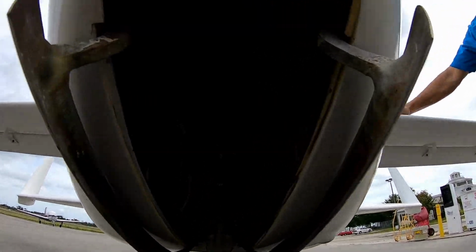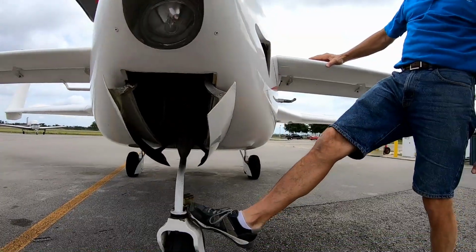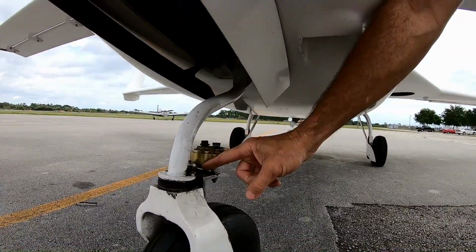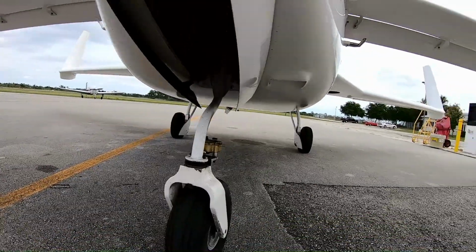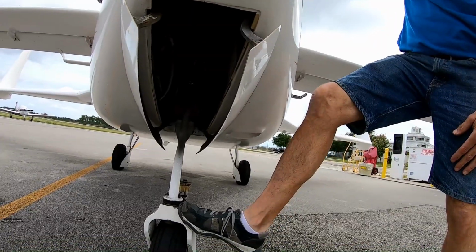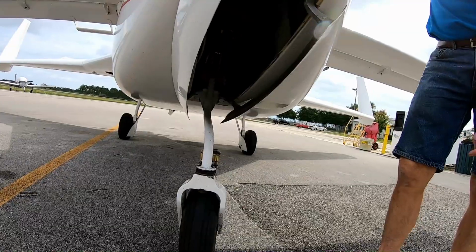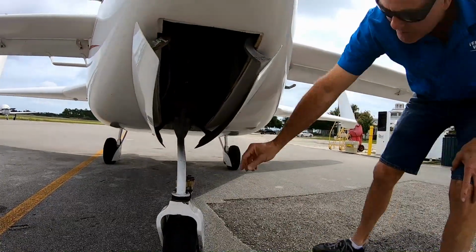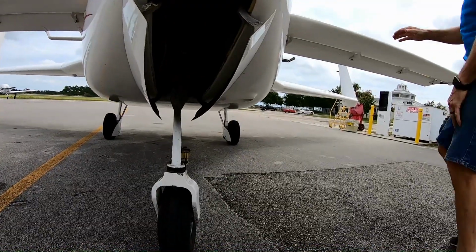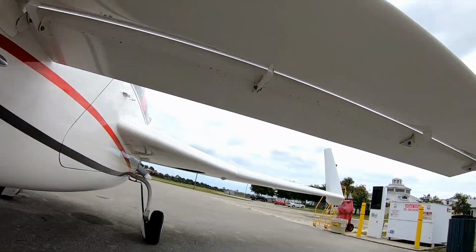So I put a flag on the last one. Yeah, because I've done that. It took off with it stuck up in there. And then you make sure the pin's engaged in your shimmy damper. That's a little Scott dampener, and it's got a fork and a pin right there. Oh, nice. Engaged. Okay, yeah. And then you set the spring dampeners, which are right there, for like the crown, just enough friction for the crown so it doesn't fall off, and then that's your regular damper. And this is adjustable, just right there, the adjusting screw. There's several different adjustments. And then again, the screws on this elevator, and we're good to go.